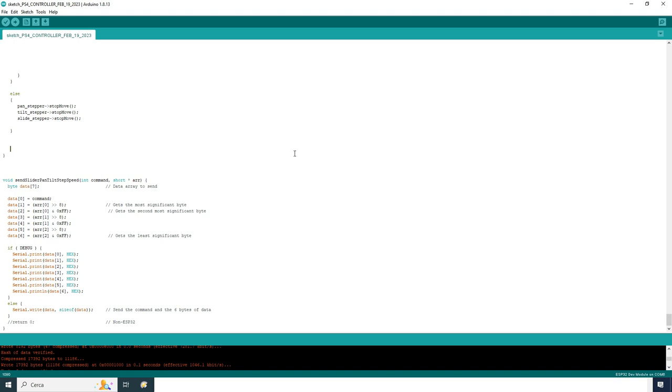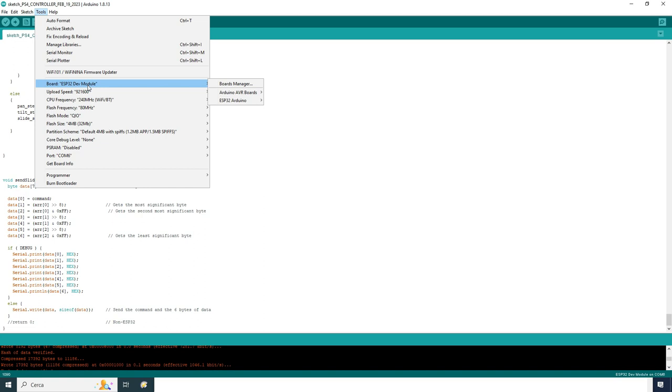So the 6-axis pairing tool, the libraries you needed to download and upload inside, then the URL to make the Arduino IDE aware that you have also other boards and not just Arduino boards, then choose here the board as ESP32, and then everything else you need to leave as standard, except for the upload speed that must be the highest possible. But if you want you can use my settings here, and obviously your COM port will be different from my COM port. And that's all. Those files will be available at my GitHub that I've already stated for part 1 and part 2.